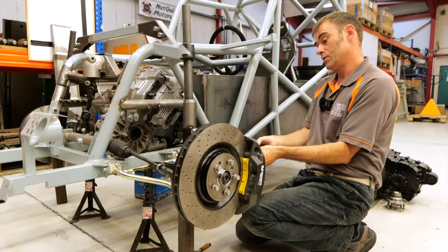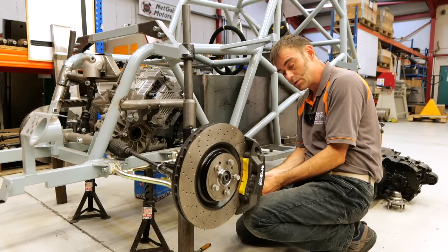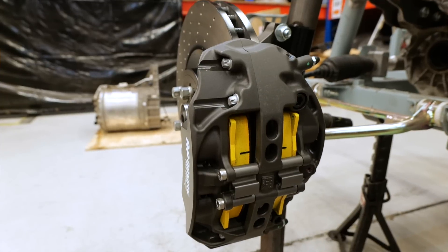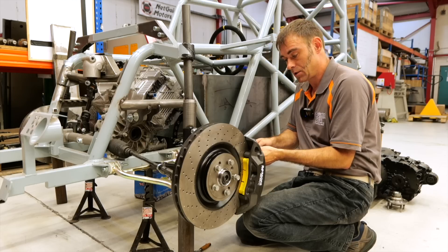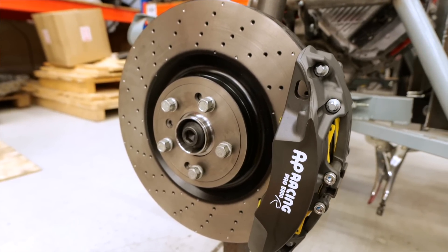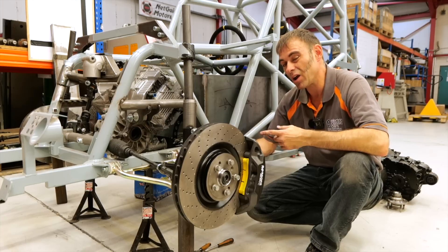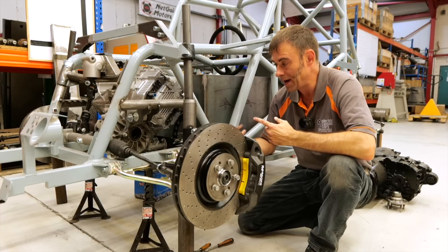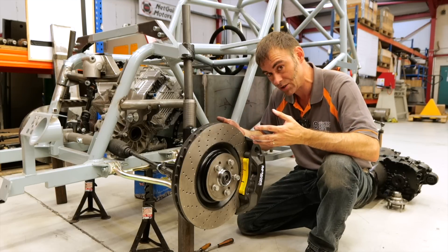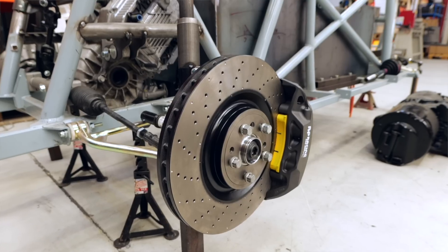They look good — serious amount of braking. Obviously you're going to get some braking effect from regenerative braking from the electric motors. But one thing you've got to watch on a race car is that when the battery pack is full, you won't get any regen because the battery packs don't want any more amps. So the regen level will be drastically reduced. On the first few corners and the first lap you'll have hardly any regen, so you still need really good brakes. Also, high regen means the battery pack doesn't get a cooling break — you're taking lots of amps out when flooring it and then putting lots back in on regen. Having some regen is good, but not huge amounts. That's why you still need big brakes.